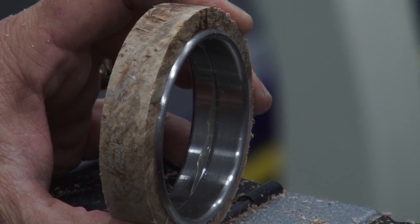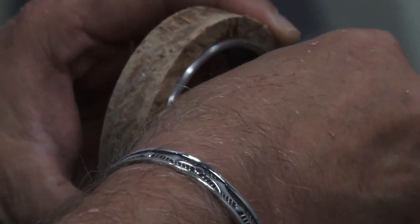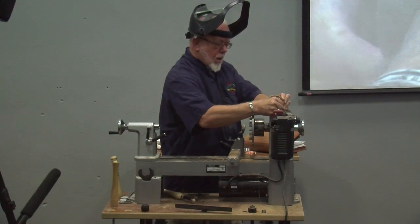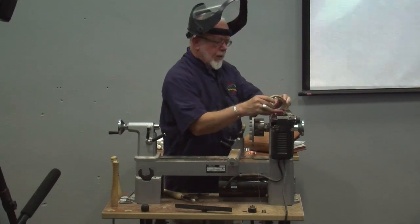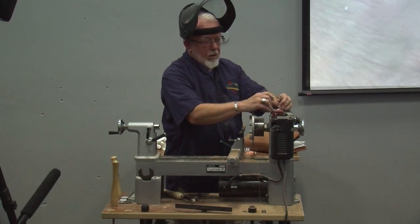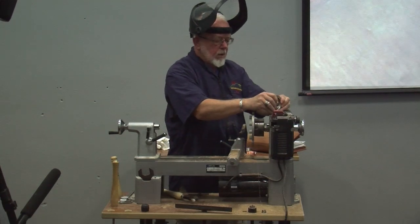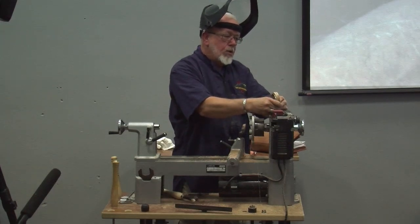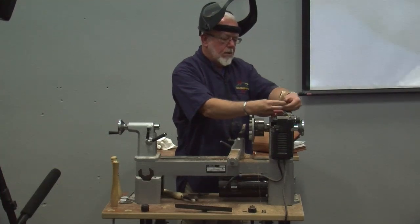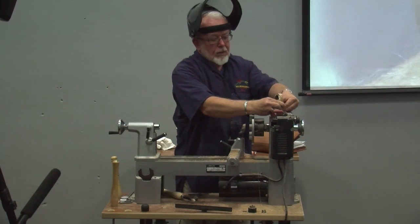It's a real thin film, where here you can peel it out, and it's going to come out like a rubber band, okay? Generally, you can get a grip on it and peel it out. And that's the easiest way to get it out, okay? This one seems a little harder today. I don't know why. You use liquid nails because it never sets up. It just stays in this plastic rubber form. So when your wood moves, it stays glued in place.